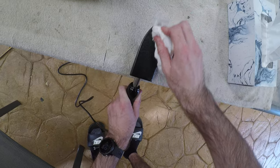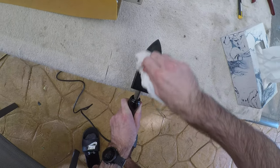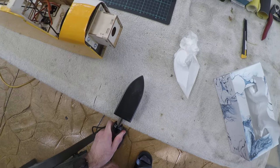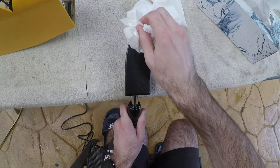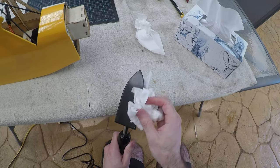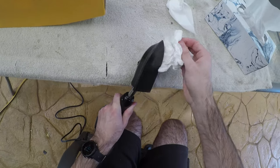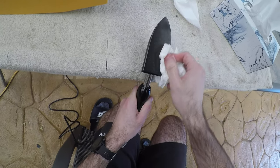I've done this so many times and burned myself so many times that I really don't mind anymore. But yeah, you can see on the tissue there all that yellow stuff — if we were to work on our face, it would be glued to our covering, which is not very good. You can do some significant damage to your skin if you're not careful. And that looks like it's coming off nicely. Most of it's off, and when you can't really see yellow on the tissue, don't forget the edges there. The iron's still hot, don't burn yourself. It's like 100 to 200 degrees or something.